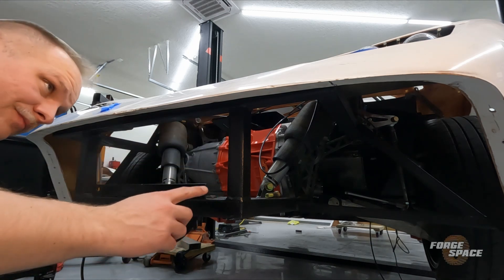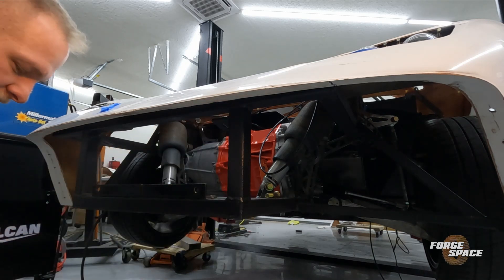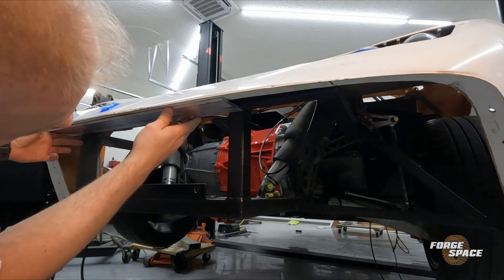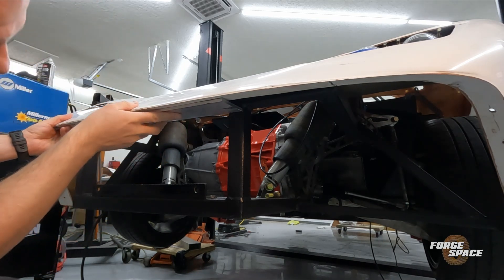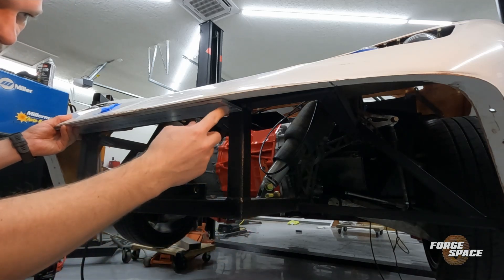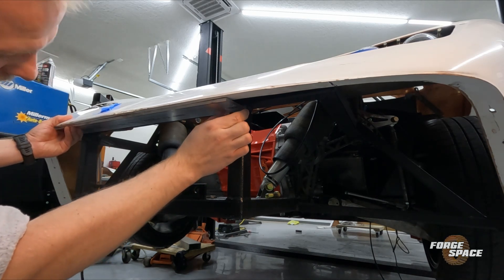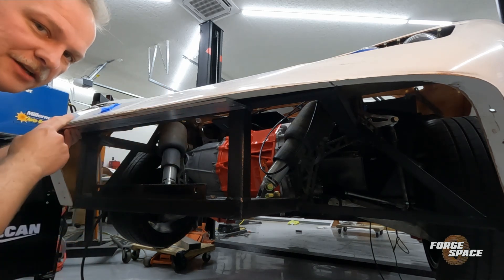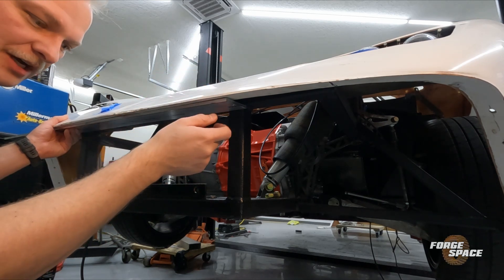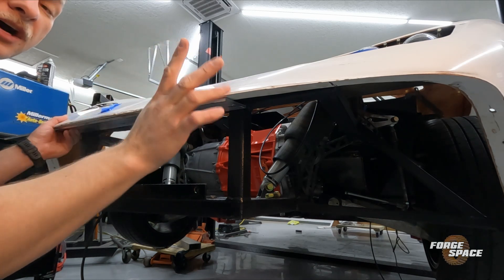Right across the front here we have the edges, so I want to use this quarter-inch plate right here. That way it provides enough bolting surface on the bottom for a good hinge point, and then we'll tack our brackets in here. I'm going to go quarter inch in and quarter inch out, cut this down to length, drill it through, put some fastener retainers in here, and then fill this forward portion with epoxy so it's nice and stiff on the front side.